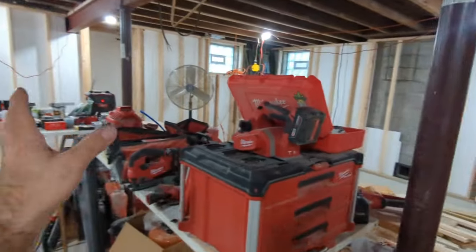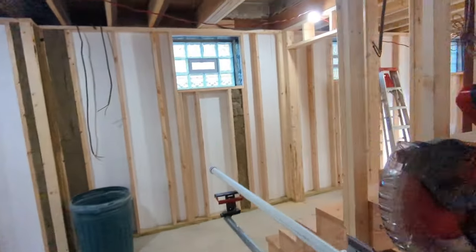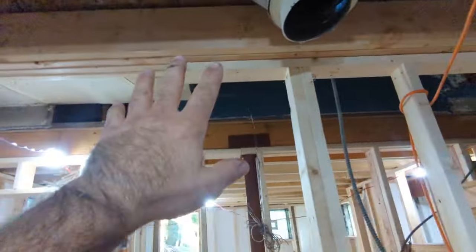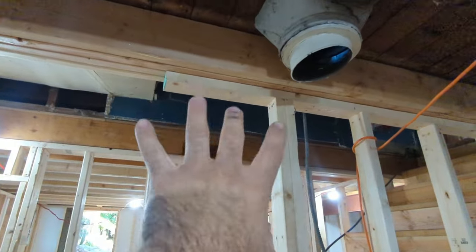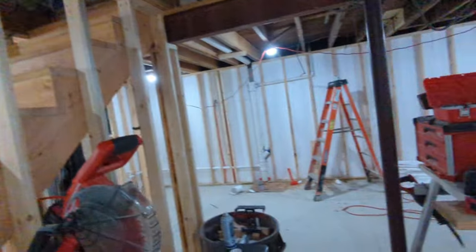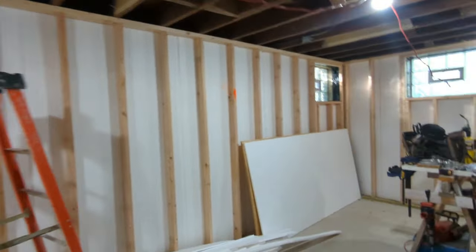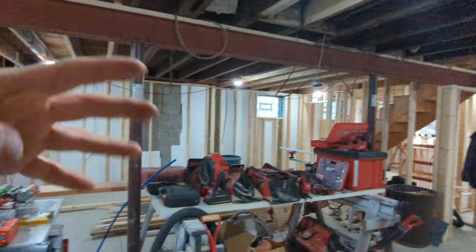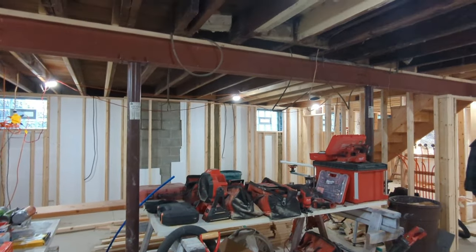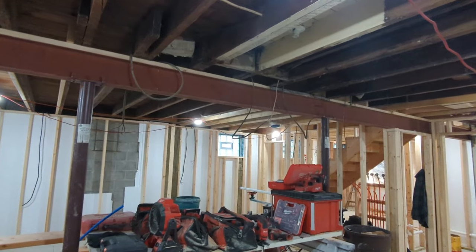The new forced air furnace would, like I say, tie into all the original vents and ducts. But as we found out here, when I replaced this beam, someone cut the original beam all out to send a hot air duct upstairs. So it's obvious to me that whoever did the heating in this house never engineered the system, didn't really know what to do or not do with it. And so if we're building all this new ductwork to meet up to the old, and a new, efficient furnace to replace the old one, which is wildly inefficient, it's not engineered again.